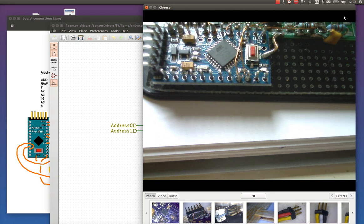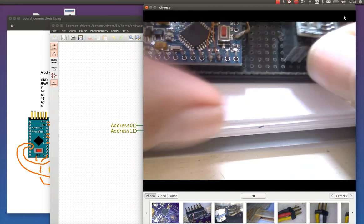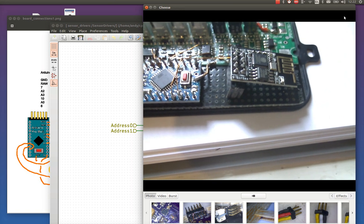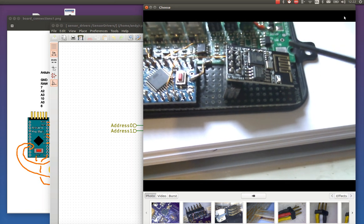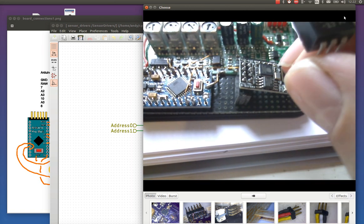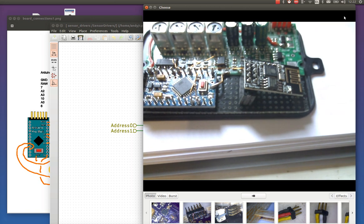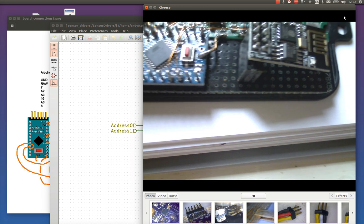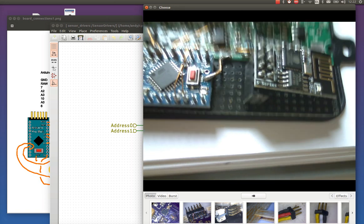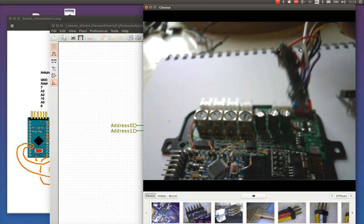The next plan is to get one of these ESP01 boards and pop it on there, so we'll have a WiFi output. I don't know what the range of these is, but the next issue is either to get a better board or try to put an external antenna on this. It needs a 3.3 volt regulator, which I've got there. These use about 100 milliamps and we're driving off 12 volts, so that might get too hot — if I can get away with it I'll do that, otherwise it'll probably need a little switching regulator to handle that current.